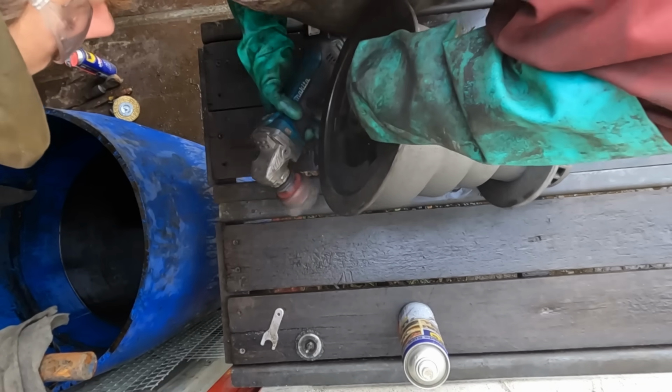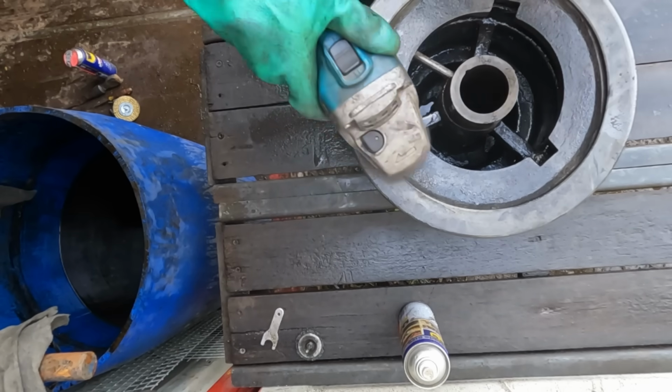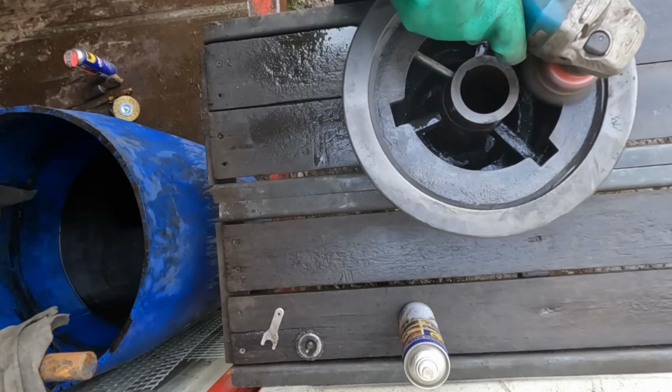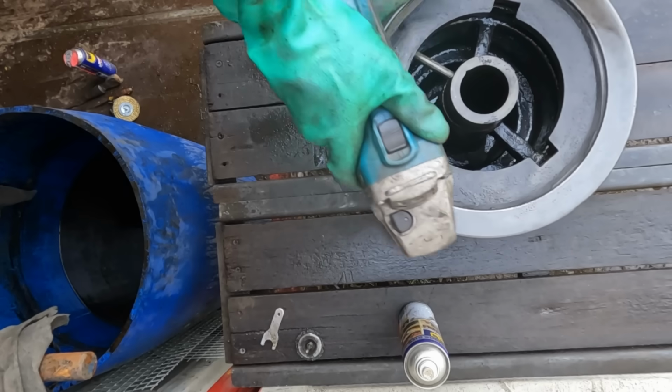The features such as the pinion on the small end for the back gears and also the belt flanges are all unnecessary for a countershaft cone. It's just the widths and the diameters of the steps which need to be identical. This is one hell of a casting.